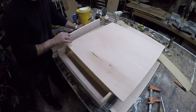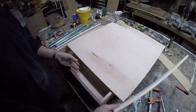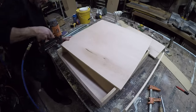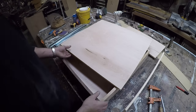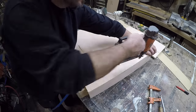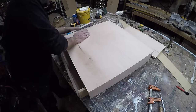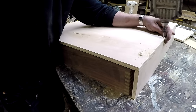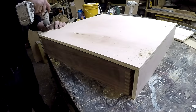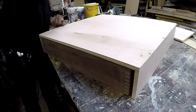I'm nailing the top to the sides — I glue them, then air-nail them, then screw them; it makes the workflow go a little bit easier. My buddy Willy is my helper on this job — he cleans and never stops. I pre-drill everything to make sure the head sinks and so I don't split anything. I'm using two-inch screws.